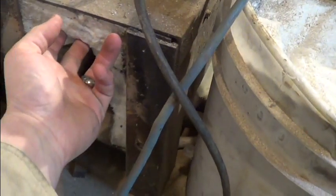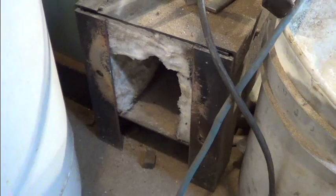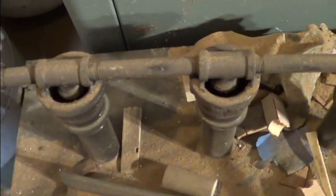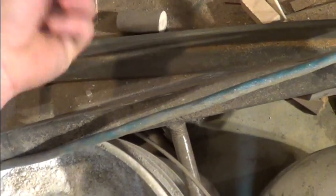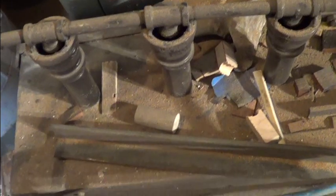You want at least two inches of kao wool with the fire brick bottom. You can't line it with fire brick because it won't get hot enough for forging. You can see how I manifolded this one in — I wouldn't do it like this again because you can't get to any of these burners now. It's a real pain because I welded these in, so they're permanently on. You can't really mess with them after that — you have to break off all the tacks.